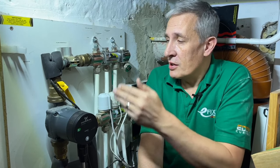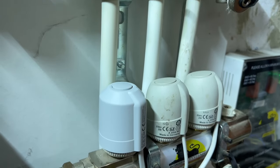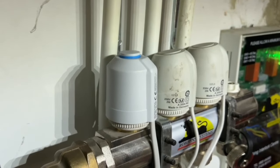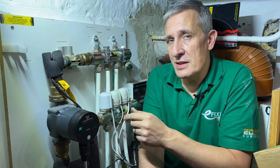From the electrical side — we're not going into plumbing today. This is the manifold for the underfloor central heating system: a collection of wires and pipes that can look intimidating at first. Each room has its own heating circuit with a flow and return pipe — hot water going in and coming back slightly cooler. Each room is then controlled by a zone valve, which the thermostat opens or closes to allow heat in and out.